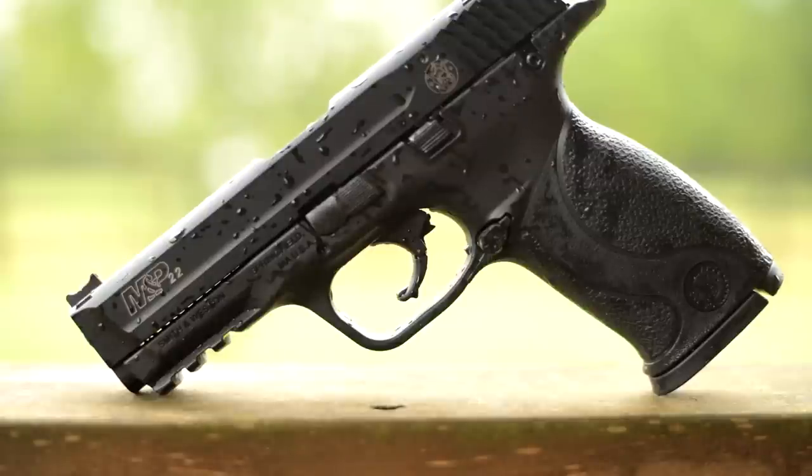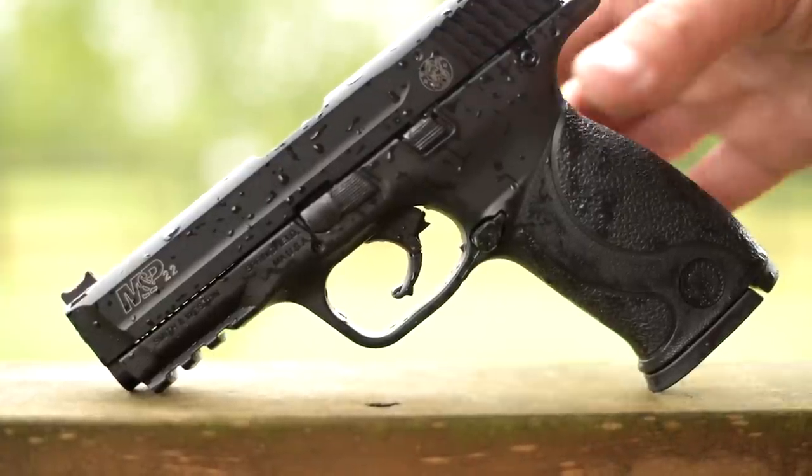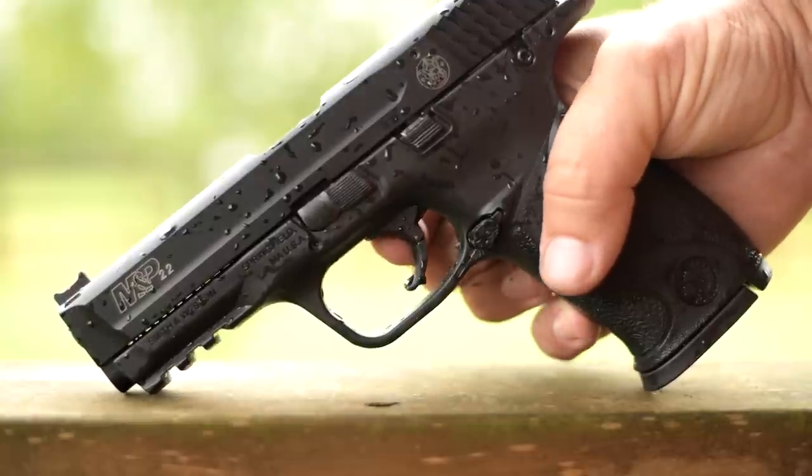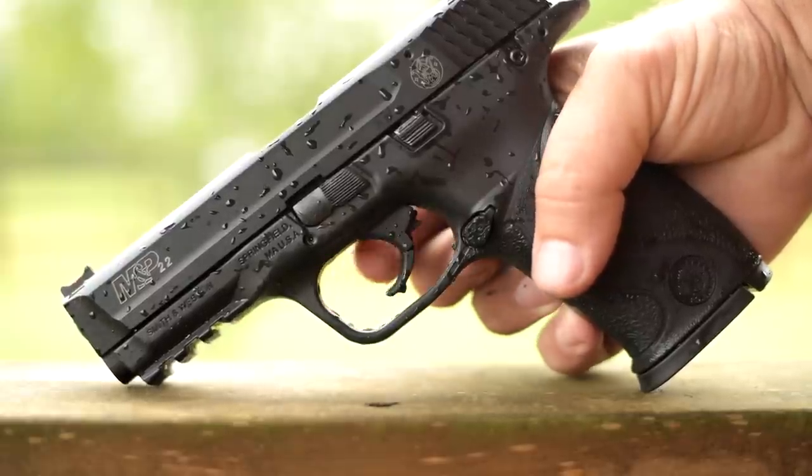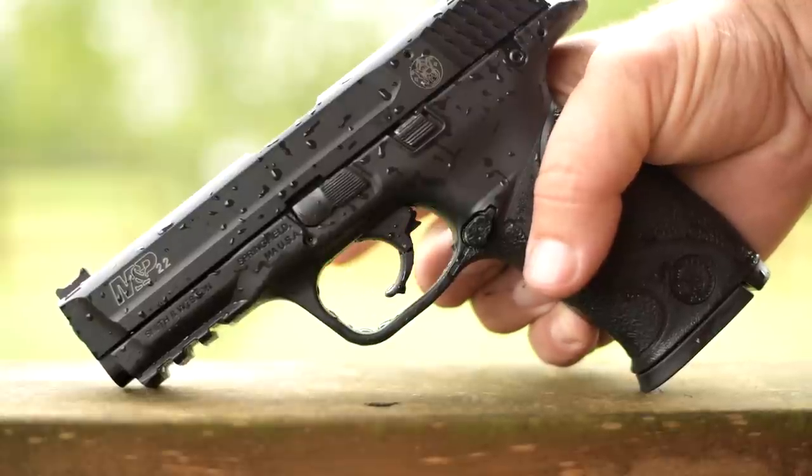For those of you wondering, this pistol does have the articulated trigger safety — you have to pull the trigger in a manner that unlocks or disengages the little catch before you can pull the trigger all the way for the gun to fire. The pistol also has a built-in hammer block safety, so even if the hammer were to fall and slip the sear, it still can't hit the firing pin unless the trigger has physically been pulled. So it's not like I'm rendering the gun totally unsafe — all I'm doing is removing those manual safety selector paddles. That's all I've got today; wish it wasn't raining so we could get on the range, but I'll talk with you guys again soon.